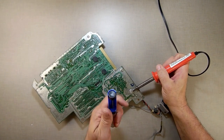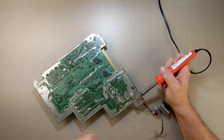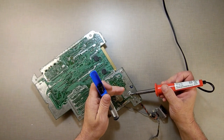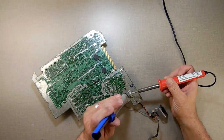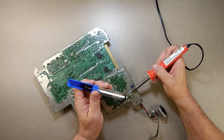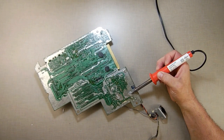This one has a lot of solder. Just take your time and work around it — you can get the vast majority of solder out. I'll show you another trick too once I get most of this out. I probably could try to use a solder wick here, but as I've said in other videos, I've never really had success with one. Maybe I'm doing it wrong, but I just seem to get the solder wick stuck to whatever I'm trying to desolder.